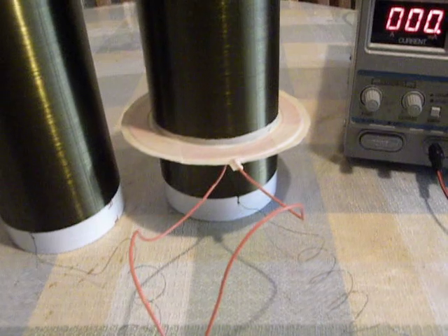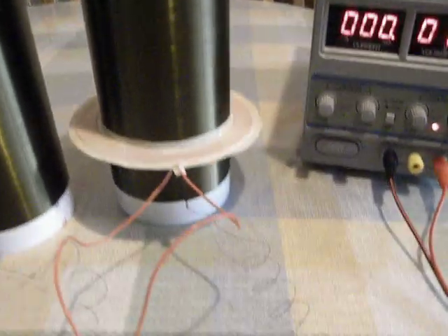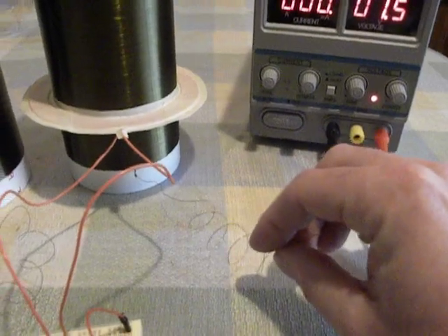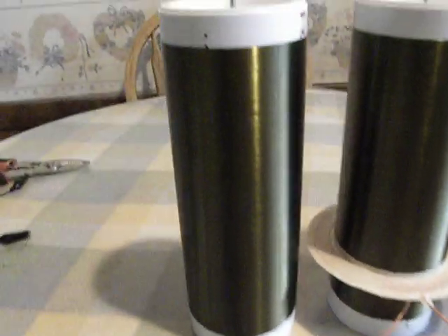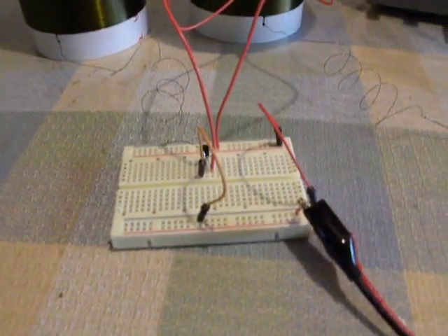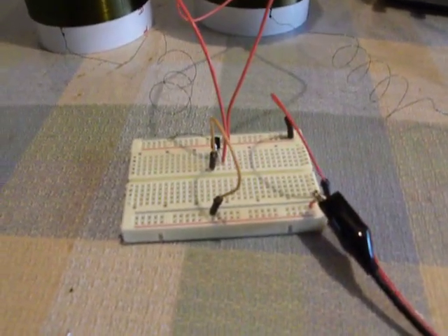Here I have the L1 coil around the L3 coil. The bottom of the L3 coil is not connected to anything. The L2 coil is connected to the transistor's base using a basic exciter setup.